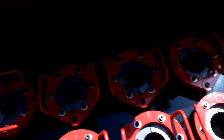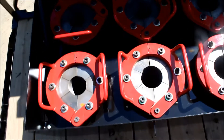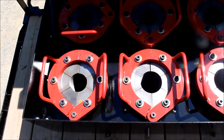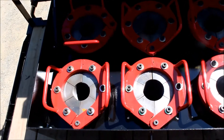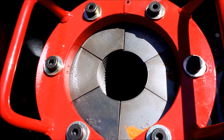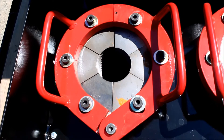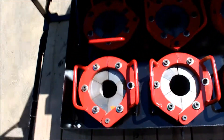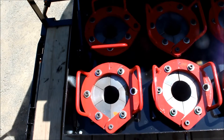Both tops and bottoms — it's a locking case. These slips are quite expensive. We build them here at our factory; the slip material is a blend of our own alloy materials, which we machine here and then send out to be heat treated to toughen them up — taking them to about maximum hardness without making them brittle. The design grips the pipe at about 360 degrees, so there's less distortion to the pipe. These slip retaining rings — one of the guys in the shop came up with that — make handling the slips nice. Some slips get quite heavy; these 3.5-inch slips are each about a couple hundred pounds, so you'll need a crane or a couple of strong guys to lift them in place.